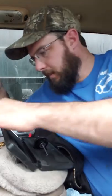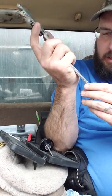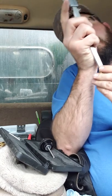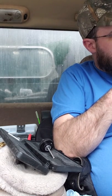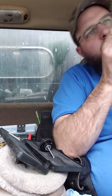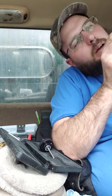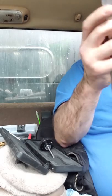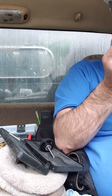All right, and then each one of those cutting depths for our key, we can use the back end, and it'll tell you. Okay, first cut is 945, probably supposed to be 10. 945. 935, 940. Okay. That's what I'm reading anyways. So number 5 cut should be 945. I'm gonna put this guy in there.